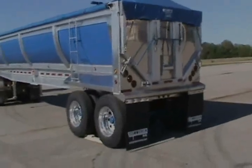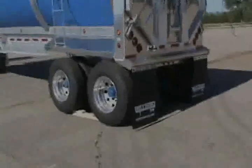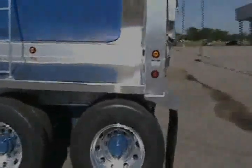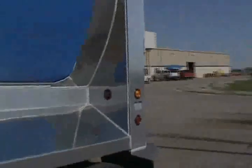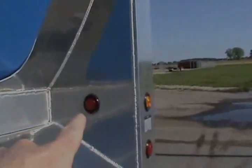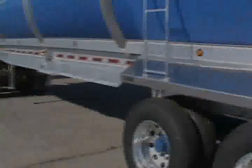All right, what we've got — we've got a trailer sitting here on a tapered block. And the way this thing's designed, when you back in, there's a tilt detector underneath. It will detect if the trailer's leaning too much — this light right here will light up, and that'll tell the driver that he's not level enough to raise. So he'll have to move until the light goes out. And once he's sitting there and the light's out, then it's ready to raise.